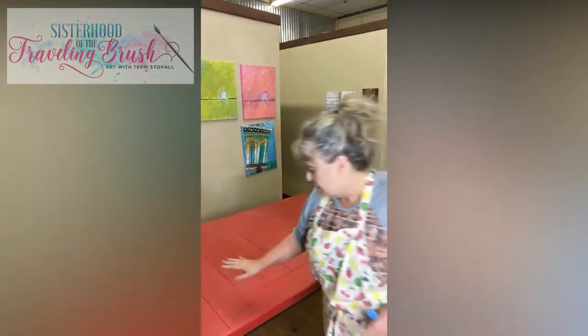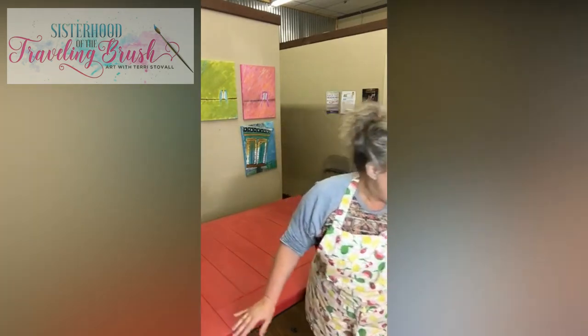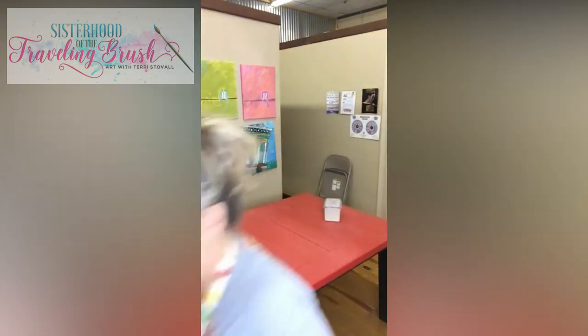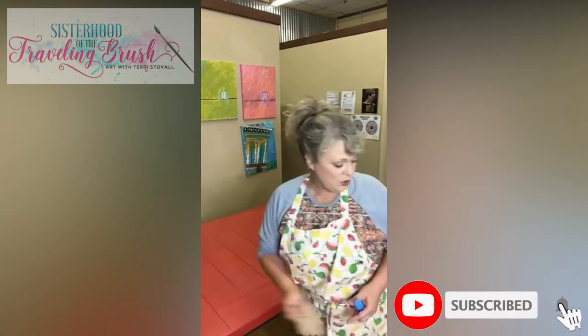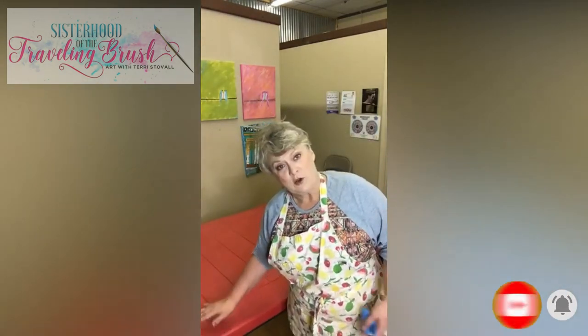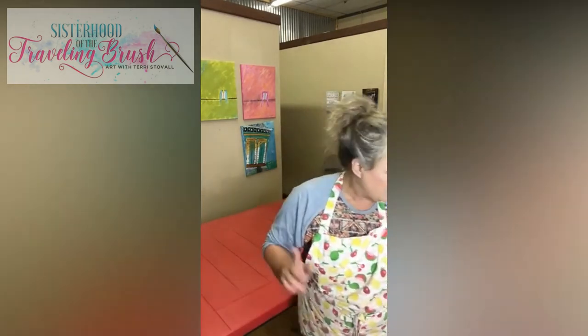Since I put the paint on — I've got two coats of paint on here, let those dry — I've got one coat of top coat on. Then you can use one of these little sanding pads. This is a Dixie Belle one, about $1.50. I had a 220 grit; they usually recommend a 300 grit, which is about the same as a brown paper bag. I went over it and just lightly sanded it. What I'm trying to do is create some grip between the layers, because when you're adding a top coat and creating a slick, harder surface, there's not as much grab for the next coat to go down.